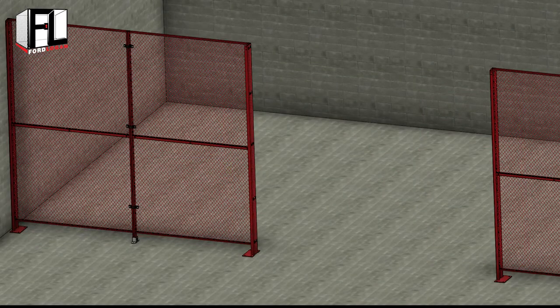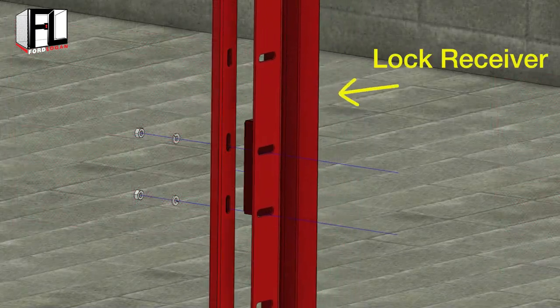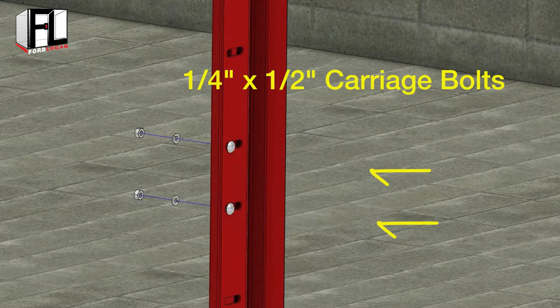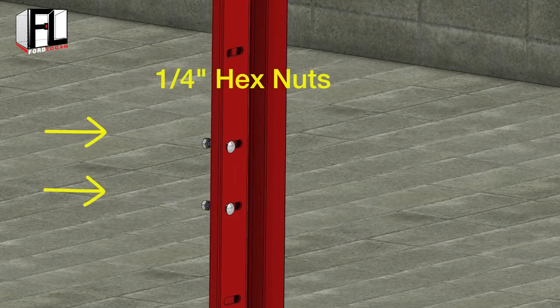The panel system should already be installed with lined posts on both sides of the door panel opening and one at the end of the track when possible. Next, bolt the lock receiver to the slide jam using two quarter inch by half inch carriage bolts, then secure with two lock washers and two quarter inch hex nuts.